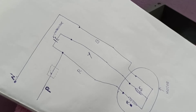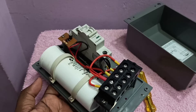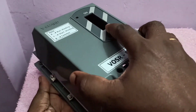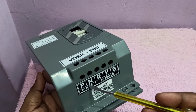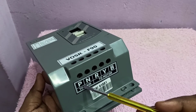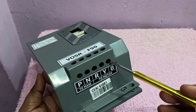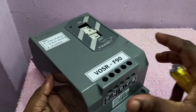Now let's go back to the starter. On the cover they have marked the connections: 'two main' — here we connect the cable from the main power supply, phase and neutral — and 'two motor' — here we connect the cables coming from the motor, red, yellow, and blue. As we saw in the circuit diagram, the capacitor needs to be connected between red and yellow.